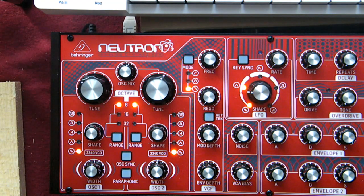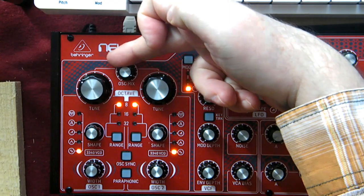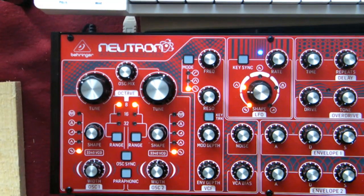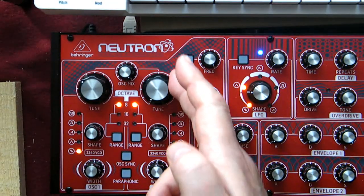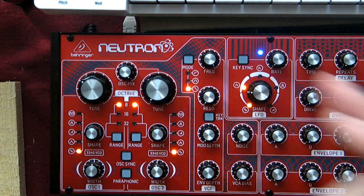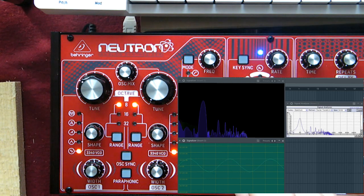I'm going to use only oscillator 2 for the next few minutes and turn the mix knob completely to the right to oscillator 2, therefore. First thing to find out is the frequency range of the tuning knobs. I turn the tuning knob of oscillator 2 completely to the deepest frequencies, completely to the left, therefore, and open the VCA bias to get sound.